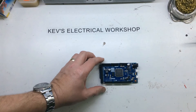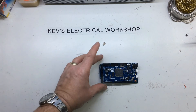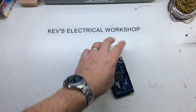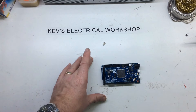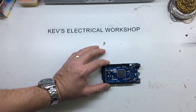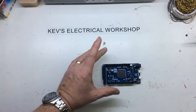The other thing about this is it has twice as much memory from what I remember. This is 512K of flash. And it's running at 84 MHz, not 16. This is a far faster beast, and I believe it's actually a 32-bit processor.